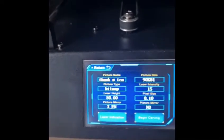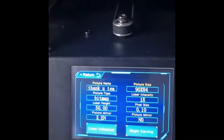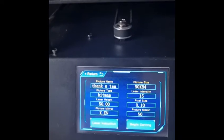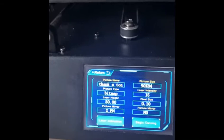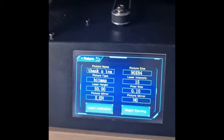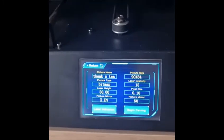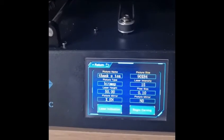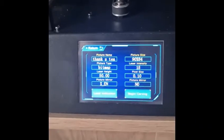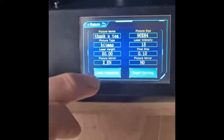I accidentally changed the mirror settings once and couldn't understand why my images were printing mirrored — so don't change those unless you have a reason. I have tried laser engraving acrylic. With clear acrylic, you need to apply a dry white marker pen first — it burns through and leaves an image, then you wipe off the marker pen. It was a bit of a faff and personally I wouldn't bother, but with a bit more testing I think acrylic engraving could be quite nice. I tend to stick to wood and cardboard for now.